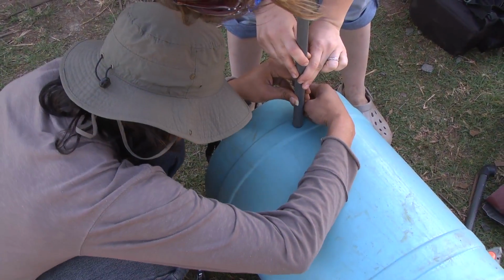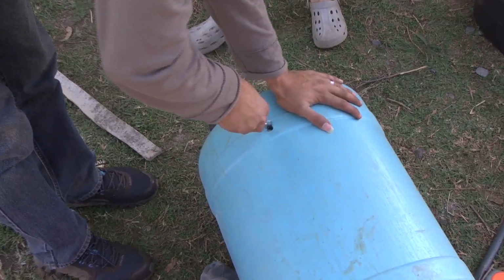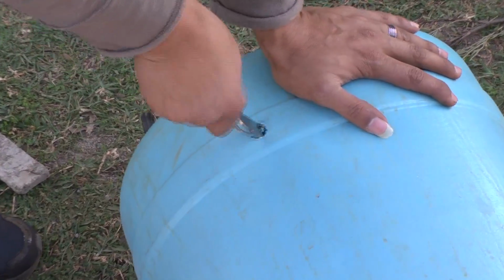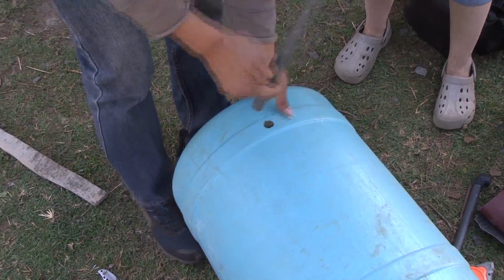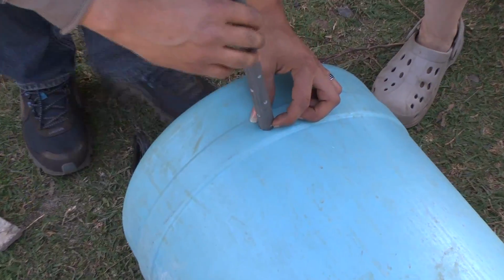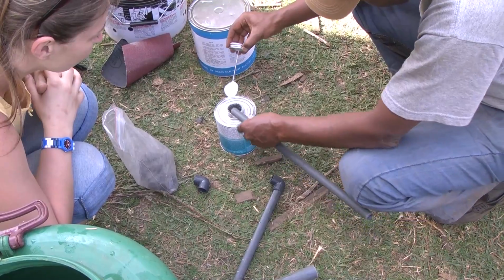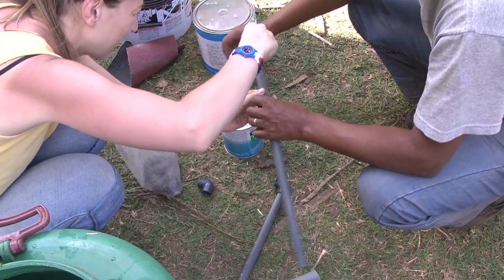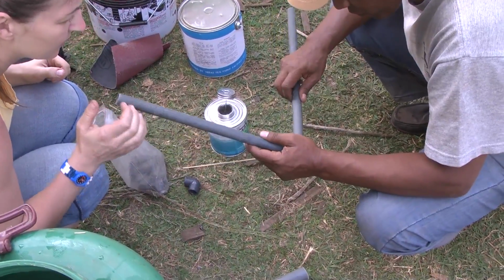Once your piping is ready, you can then cut a hole in the tank where the PVC piping will exit. This hole should fit tightly with the diameter of the piping to avoid water leakage. For all of the PVC elbows and the outside hole on the water tank, non-toxic waterproofing glues should be used to ensure good connections and a watertight seal.